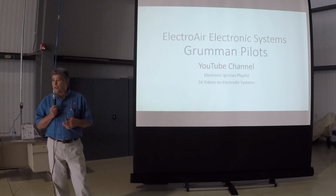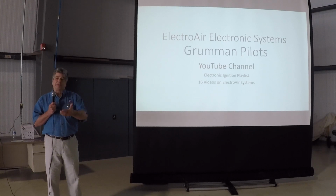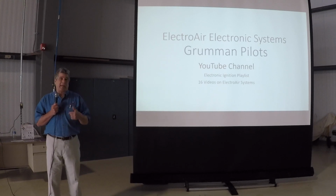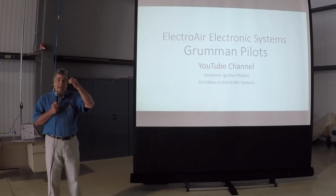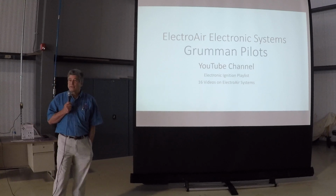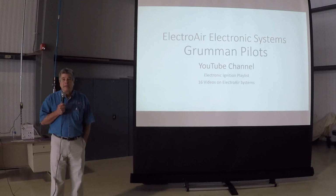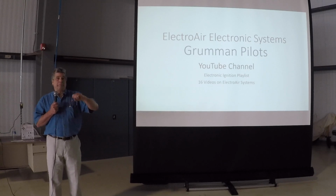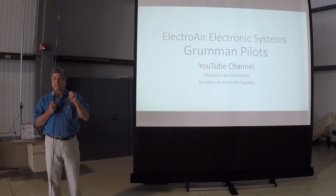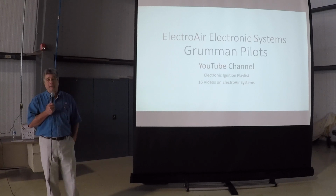One of the things that I do when I fly a customer's airplane, a lot of times I'll go pick up the airplane, I'll do the annual, I'll do the install, and I deliver the airplane back. When I'm flying the airplane back with electronic ignition, once I get up to cruise altitude, I usually reach over and turn off the magneto. And if you look at the digital tachometer, I don't lose a single RPM because the mag's just along for a ride. So instead of making the mag try to fire in a high pressure combustion environment, I just turn it off.